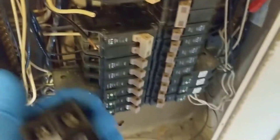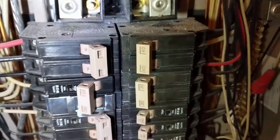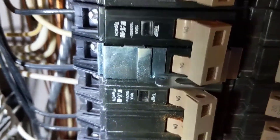Got a new 30 amp breaker right here. I'll get the lock on, strip the wire, hook up the wires on the new breaker, and pop it in place. New breaker's mounted, got the wires nice and tight. Let's flip it on and see what happens.